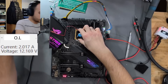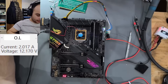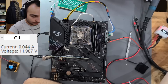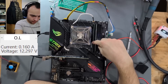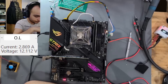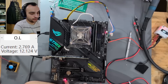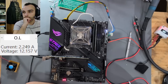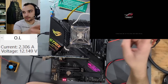The board is already on at two amps. Let me get a GPU in here and see if I can get POST output from that. Trying it now with a GPU and a bigger cooler. I'll put two RAM sticks in here in slots A1 and A2 — so just the one channel. The board is restarting again, going through all the POST codes. Let's see if we can get a picture through the GPU this time. And there it is — now we have a POST screen. The board is on.